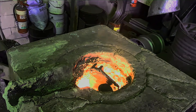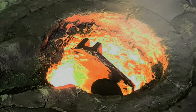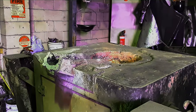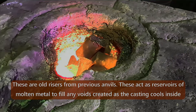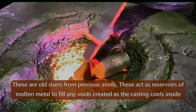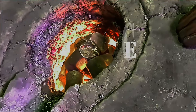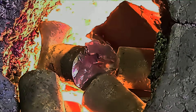Just starting the slide in again. The more metal I get into it, the quicker it starts melting. The 500kg furnace - there it goes, falls in. We like to action replay the metal sliding into the furnace. From when I start that furnace to get the first bit red hot, it would take literally less than a minute - very efficient. And the little 100kg furnace, that's less than half a minute to have the metal red hot. I'll melt 100kg in 20-30 minutes maximum.